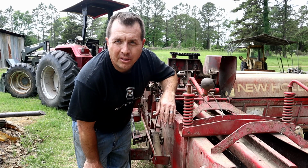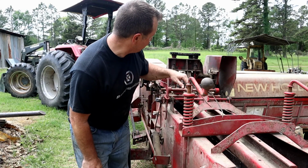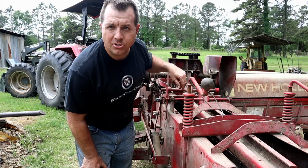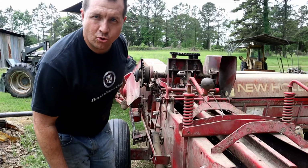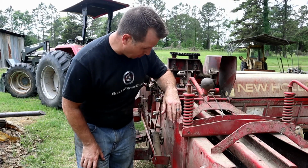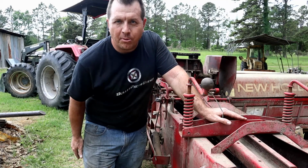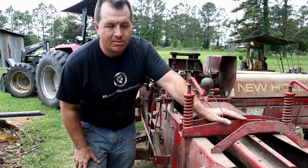All right, guys, now that we know all the dangers of the rotating equipment, unguarded big knife in there, and all the stuff that goes on back here, all the wire cleaned out of our knotters and our baling wire set up down there to make that first knot, now we can start the tractor. You want to make sure your drive shaft for the machine is fairly straight. And then just be aware, you've got unguarded rotating equipment all over the place. I remember reading somewhere that farming is one of the most dangerous jobs, and probably is. But anyways, let's make our first knot here